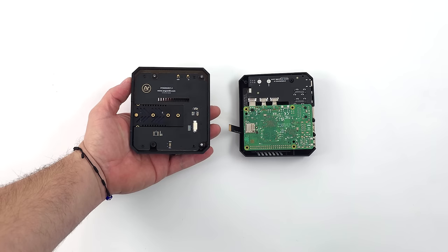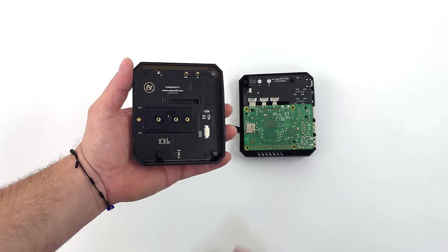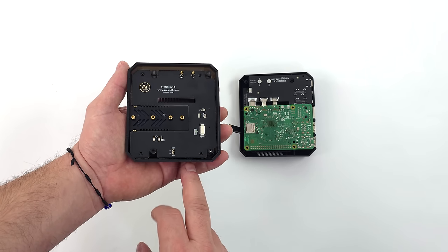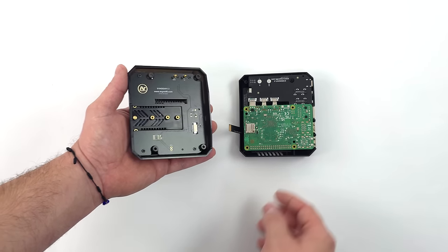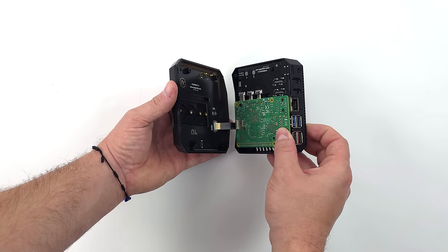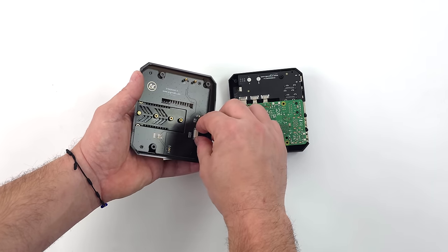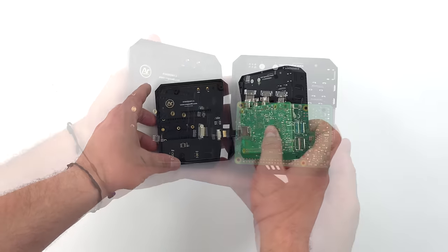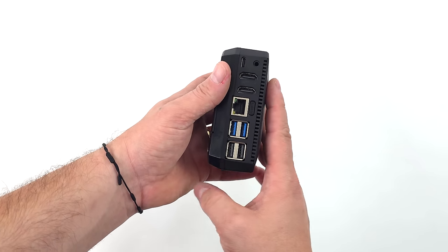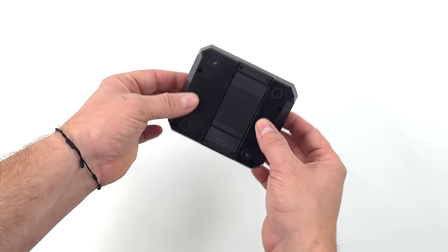The daughter board we installed on the Raspberry Pi 5 has power outputs to power that NVMe drive — it's actually set up really nicely. You just need to lay this down on the table and plug the ribbon cable into the connector on the NVMe half. It can be a little annoying but it's not that hard to do. Once we have the ribbon cable plugged in, we fold everything over and it goes right into place. Four screws secure the top half to the bottom, and we've also got some rubber feet that we can install.